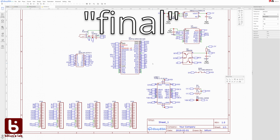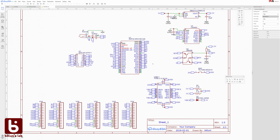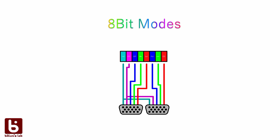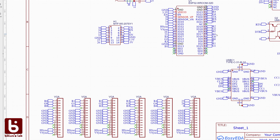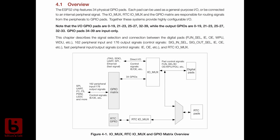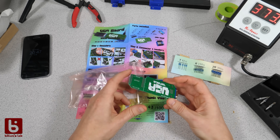For the final design I wanted more flexibility — to be able to use either two displays with three-bit color each, or six monochrome displays. I decided to use every pin available to give each R, G and B signal an individual pin and use the internal GPIO matrix of the microcontroller to control the signals by software. The GPIO matrix has the possibility to route an internal bit to multiple physical pins, which would give me enough flexibility to run the displays in color or monochrome.